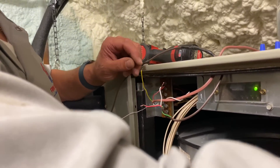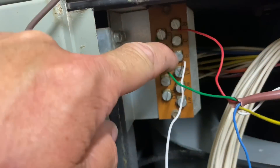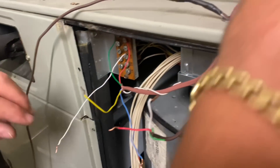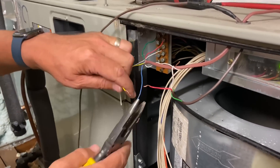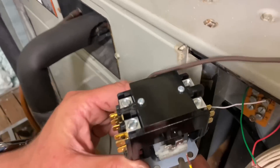I wonder what this extra wiring is about — maybe an old thermostat or a boiler connection, I don't know. We need 24 volts. I took the white wire which was going to Y and put it to B — B is Trane's version of C. So here is our common wire. There's a blue wire that's a bit stripped and unclear where it's going, but our yellow is now getting 24 volts, and white is common.